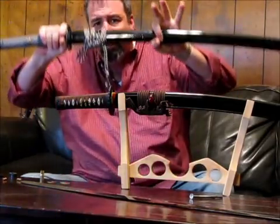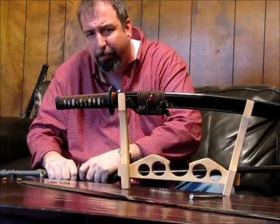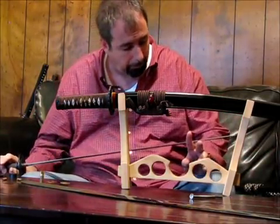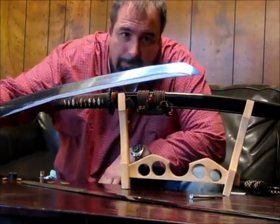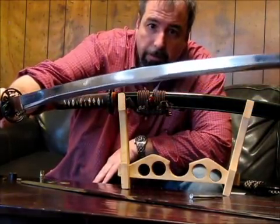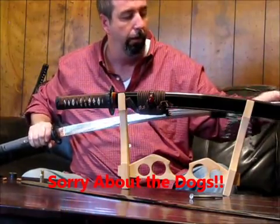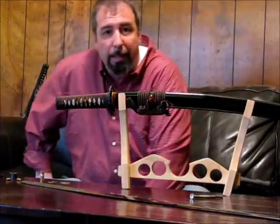So, this is a custom katana from a South African smith, James Rowe, and it's made out of EN45 steel. It is differentially hardened and water quenched, resulting in a real hamon. However, it is heavily etched because the EN45 does not show a good hamon. So you can see here, that is the appearance of a natural but etched hamon.